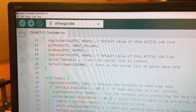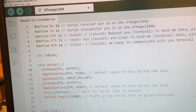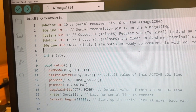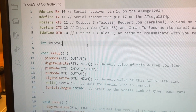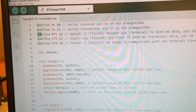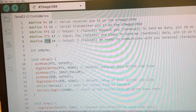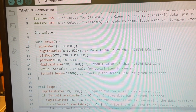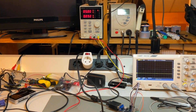For the TTGO terminal emulator, we actually only need RX and TX — we don't need anything else. But I want to make Thalus compatible with retro terminals, old-fashioned ANSI terminals like the VT100 and dozens of others. I have a little collection of old terminals. That's why I added the other lines. Even if we don't really use it all — I'm not using DTR — I want to make sure that Thalus is ready to allow people, maybe by changing the sketch, to interface to any classical terminal as well.